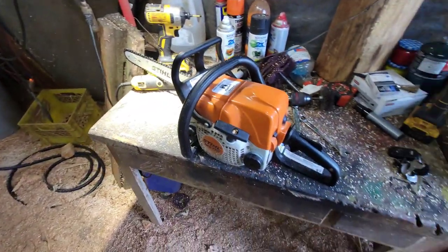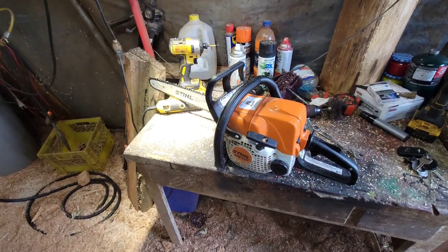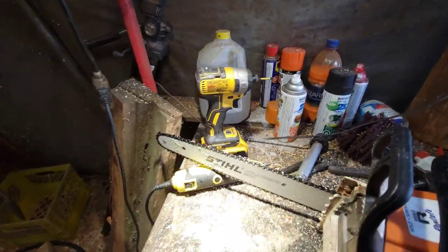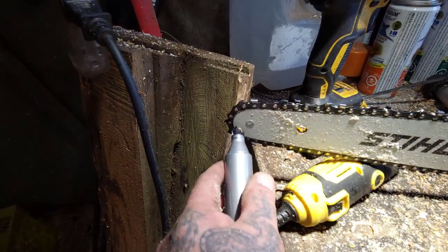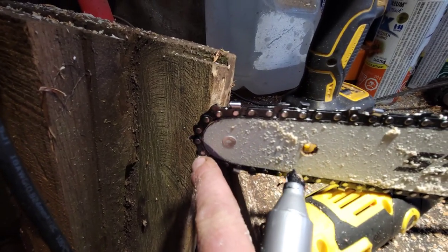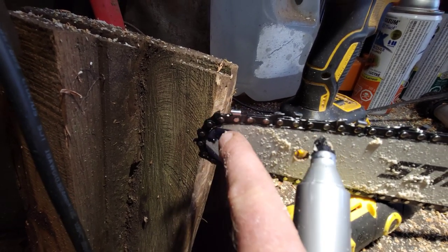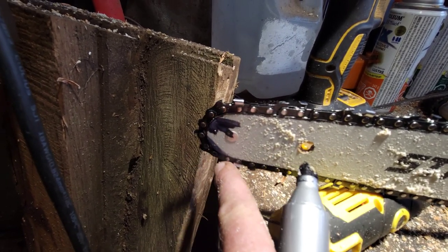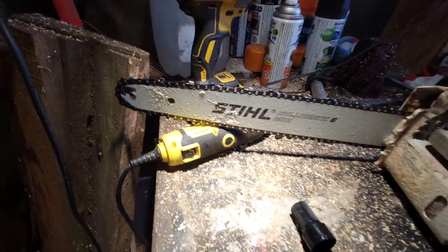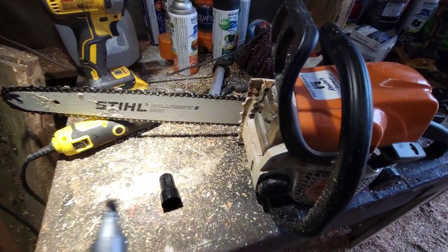And I'll do it with this. Like I said, you could do it with the 170 with a stock bar, but just use this bottom part of the bar when you're doing thin cuts. Don't use up here, because if you use up here, you're going to get kickback. But if you use down here, you're going to be safe. And just be safe, that's all. I don't want anybody getting hurt on my videos.